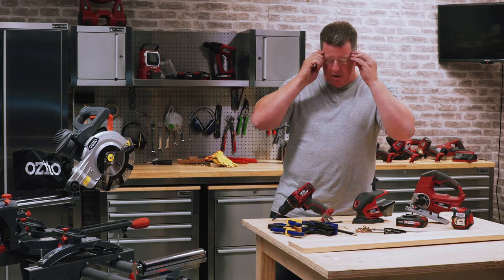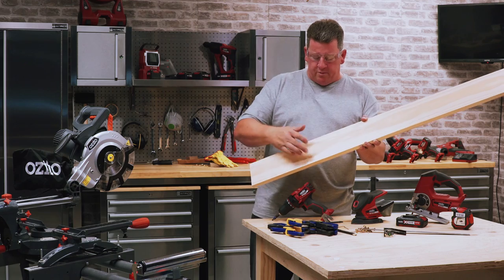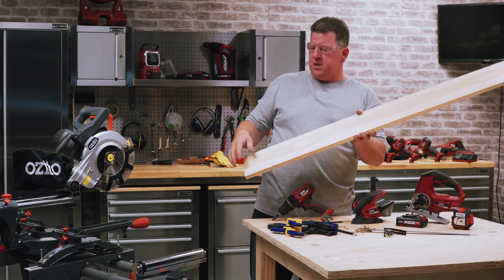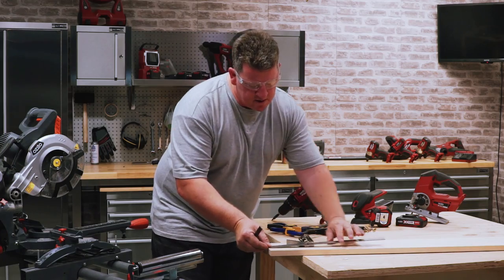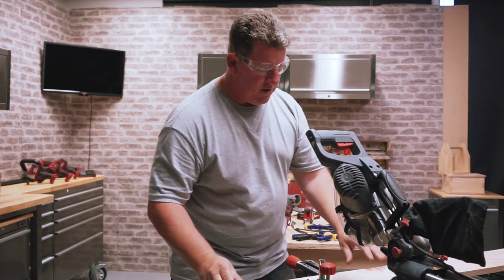So get the specs on, and we've got a piece of timber here. Now I already know that this is going to suit the size of the pot that I'm doing, so I'll be creating a base, and we'll be cutting this up with our mitre saw, and then stitching it all together with a few screws, and then cut a circle on top for our pot plant to sit in. So we're going to create a measurement for our top and bottom of our pot holder. Let's put this one onto the mitre saw.